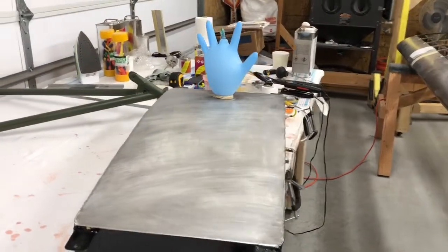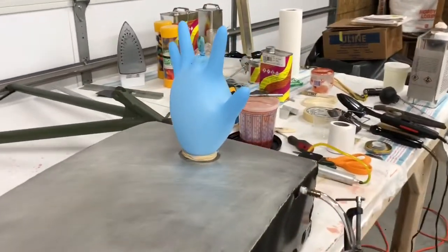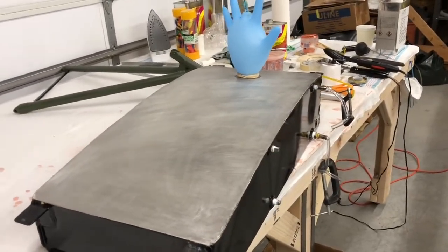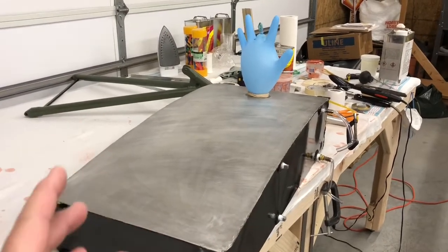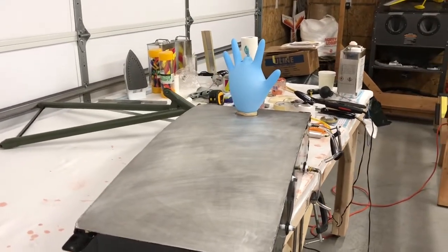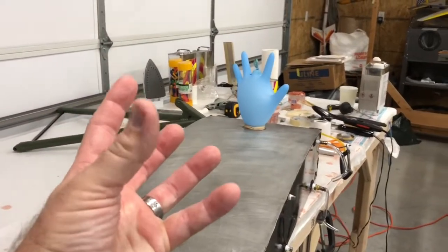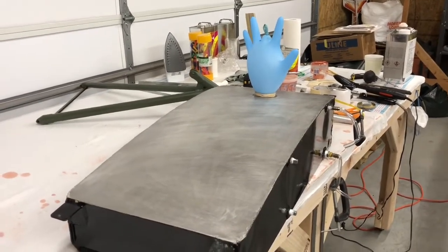Alright, back after 24 hours. As you can see, the glove is still blown up good. What you want to make sure is that the air temperature in the room is roughly within five degrees or so — stays around the same temperature — because if you air the tank up and the room is, say, 75 degrees when you blow it up, then it cools down into the fifties at nighttime, that glove is going to deflate because the air is getting colder. That's going to make you think you've got a leak in your tank.